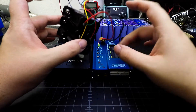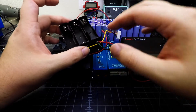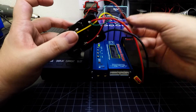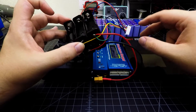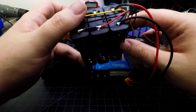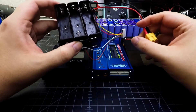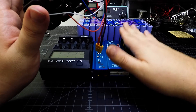The idea behind this pack is that it uses a 6S balance lead, so I can put six batteries in and charge them six at a time. Regardless of their individual state of charge, using this balance lead on either the iMax B6 or the ISDT SC-620 ensures each cell is charged up to 4.2 volts individually, making sure no single cell gets overcharged.